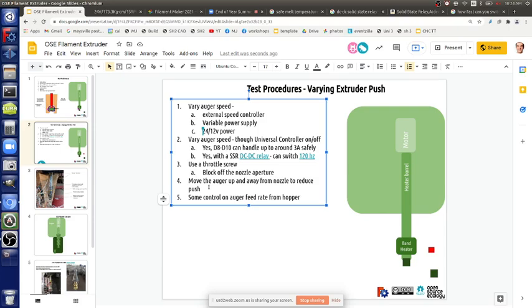The thing we want to get away from is, we do have the nice round pellets, but the goal here was, see the nice round pellets, they flow down the throat of this heater barrel more easily. They're smoother, like little balls. We can use those if we want to, and that would be good for testing, but the point of this is to show that we can use regular regrind, which is rough and could be irregular, and that this 1-inch barrel can handle that. Otherwise you're reduced to pellets, which are still $1 a pound, like a virgin material feedstock from the industrial supply chains. We're more interested in the waste feedstocks, which are 10x to 100x or 1000x cheaper than that.